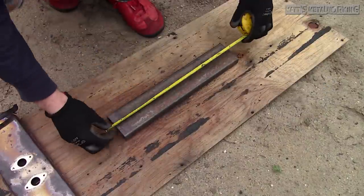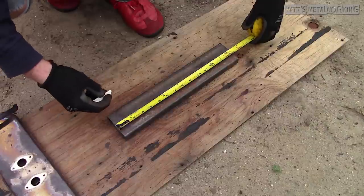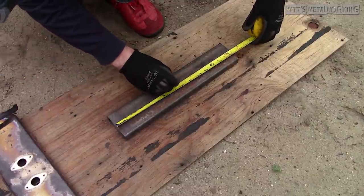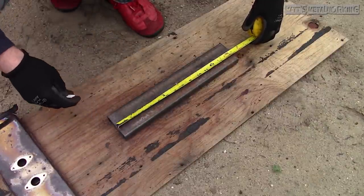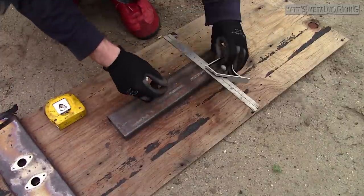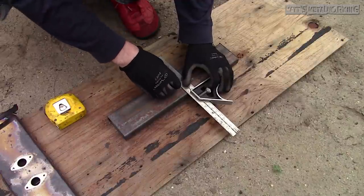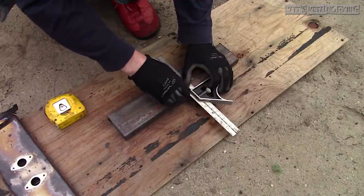I tried to roughly match the existing dimensions of the old burner. The old burner was made of a very thin sheet metal and apparently stainless steel, but obviously a very low quality. Starting out I'll need to cut the tubing in half using cutting discs on the angle grinder. My plan is to weld a divider in between so this does have a dual zone burner just like the old one.